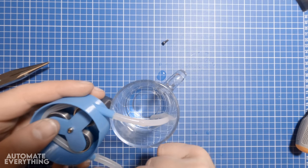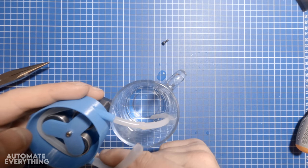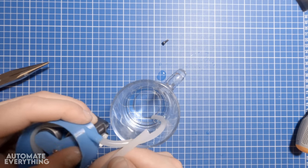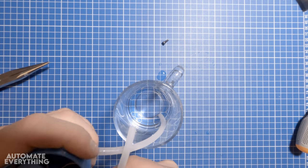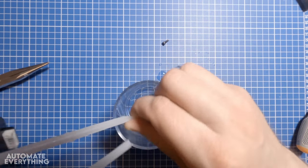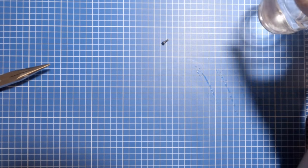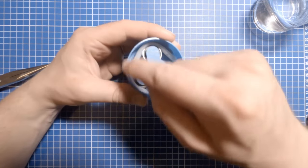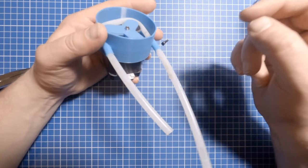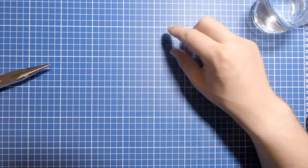In this position there's a fully closed loop. We have a glass of water, insert the input end of the tube, and rotate it — you can already see a bit of water. If I turn it hard enough, yes there is water! When I rotate it you can see it pumping water from the glass. We need improvements: to get the tube fully enclosed, make the input and output thicker, make the side walls bigger, and fix the holes and top shaft. If I push it slowly, we need it to push a bit harder against the wall because it's not a fully enclosed circle and can't create a full vacuum yet.